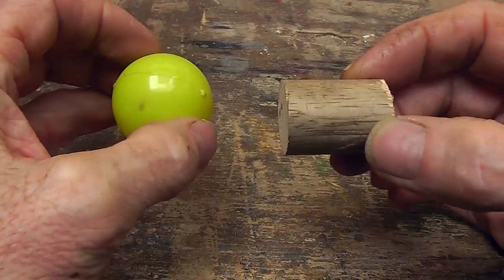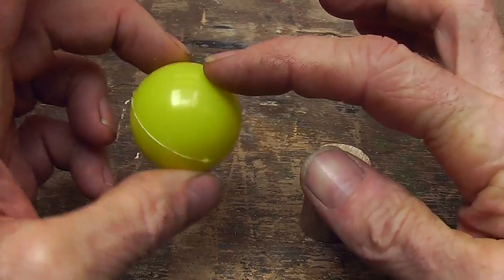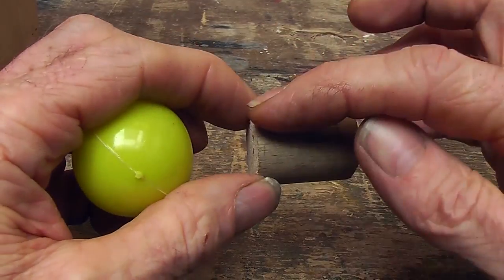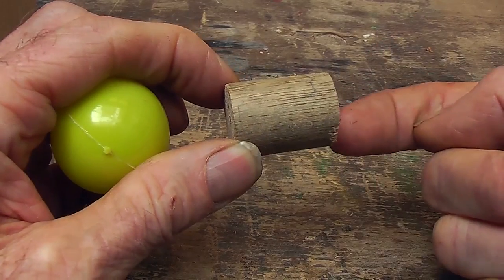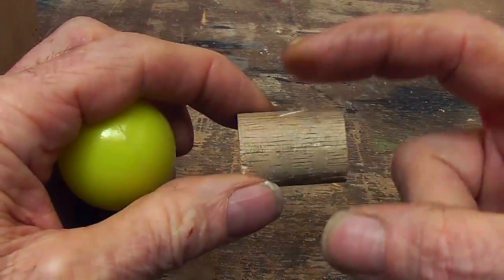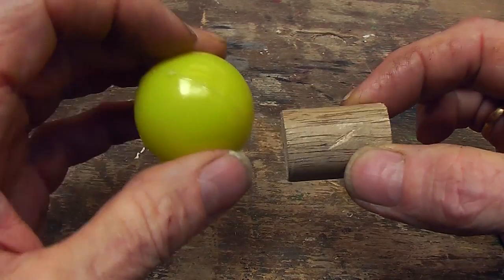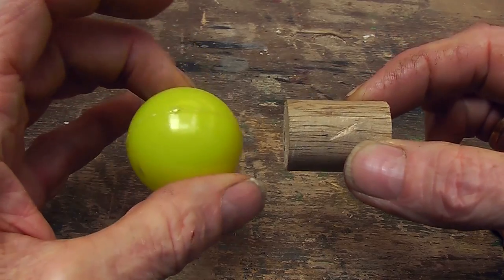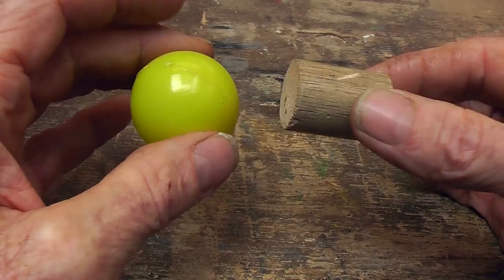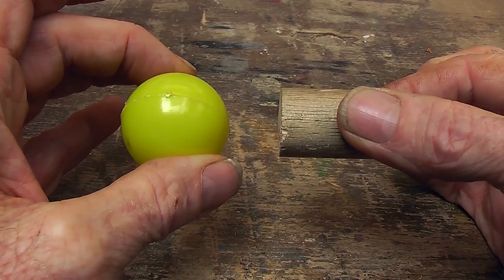The difference between a roller bearing and a ball bearing is that a ball bearing has only two points of contact, so it has a lot less friction. The cylinder has two lines of contact, so there is a little more friction, but it can take a lot more weight — roller bearings are a lot stronger than ball bearings. But our little hand generator is so light and small that it really doesn't justify either type of bearing, so we went with something a lot more simple.